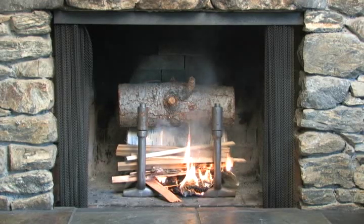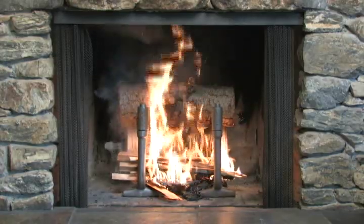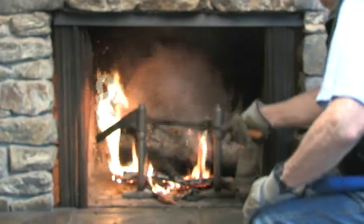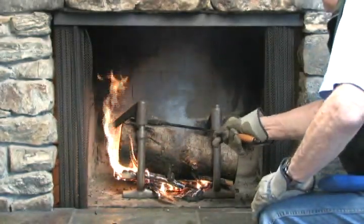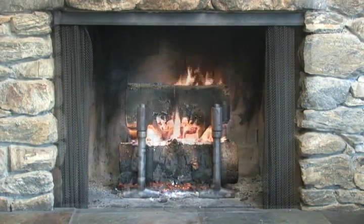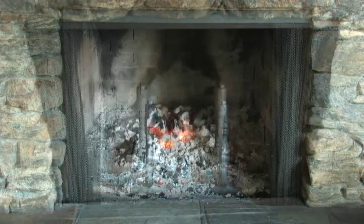Light the fire and enjoy the benefits of a clean, efficient burn that makes start-up a breeze and frequent fueling a thing of the past. When the kindling in front burns down, simply rotate the upper rests away with a poker, allowing the upper log — 6-inch or 4-inch — to drop and replace the kindling. Replace the upper rests again and place a new log on top to continue the cycle. When all the logs are burned down, rake the coals forward and replace all three logs with a new charge as before.